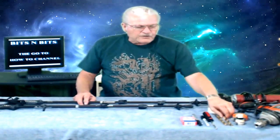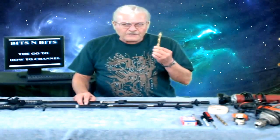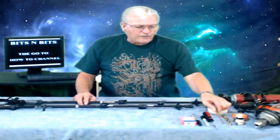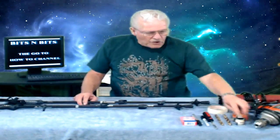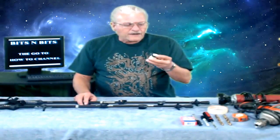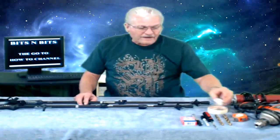You're going to need 2 drill bits. You're going to need a 15/32, and you're going to need a 29/64. This one is just a 1/64 of an inch smaller in diameter than the other bit, but it's what we need to complete this project. You're going to need some acrylic paint. Now, this is actually optional. It's just going to protect your metal, because you will be making marks on the metal, so you know how to put things back together later.